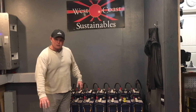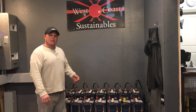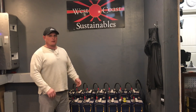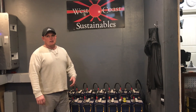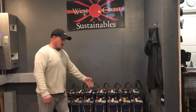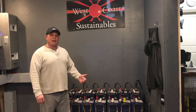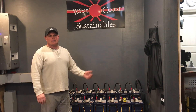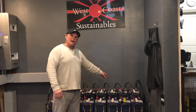By catching it early, we were able to get a replacement battery. We're going to switch this out and hopefully we don't start losing other batteries. When you start losing a lead acid battery, and the other batteries have to start compensating for the voltage change, it's like a domino — when this battery goes out, it takes the next weakest link and just starts going downhill from there. This is where I see a lot of people lose the whole bank because they didn't catch the one battery that went out first.